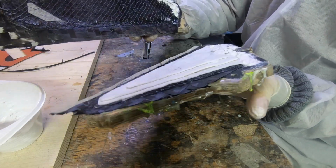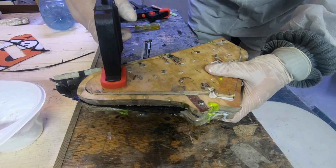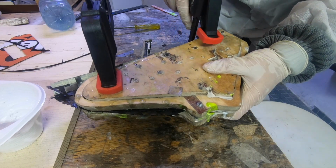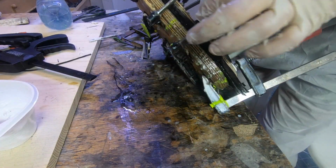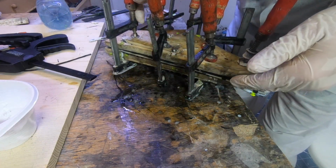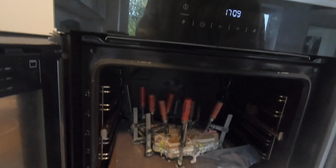Okay, now I put these parts together. Great. And I start pressing at the tip to not allow any resin to float this way into the surface of the fin. I don't want any white resin in the surface. This is a good result because there's resin coming out, but it's not too much and it comes out very evenly. So not a lot more here than here, for example. If you don't use the oven to speed this up, then give it 2 days to harden.